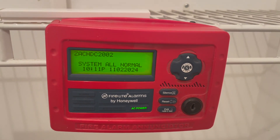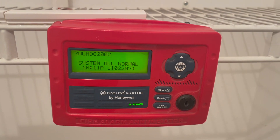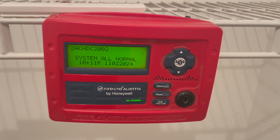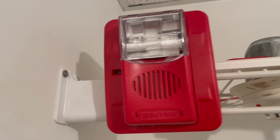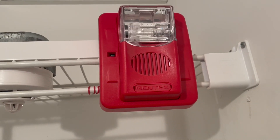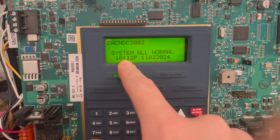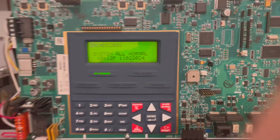Everything's still the same — smoke detectors and whatnot — but we have new notification appliances. This time we will be putting all the detectors through full functional tests and not just using the screwdriver to hit the test button. Today we have Gentex Commander Threes, both set to 75 candela. I have them set on Code 3 chime and they're synced via the FACP. As soon as I'm done filming I need to go into programming and set the clock back one hour since today we go back to standard time.